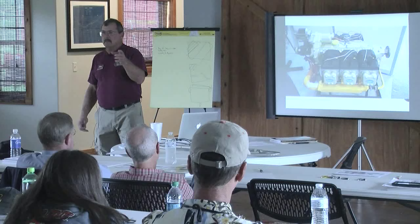What RPM do you recommend cruising at for a 165? I usually cruise at 2,600 or above, sometimes down into the 2,500s. Running like you stole it — going from 2,650 down to 2,550, you're not going to save that much gas. Gas is cheap compared to a $25,000 overhaul. Oil is cheap compared to a $25,000 overhaul. Change your oil. I use 15W-50 Aeroshell.